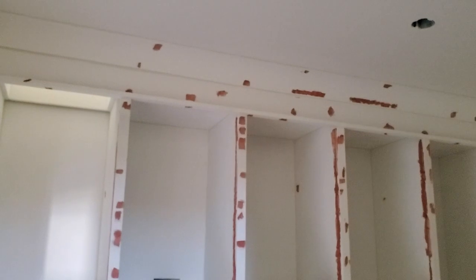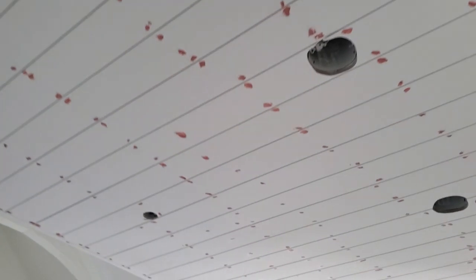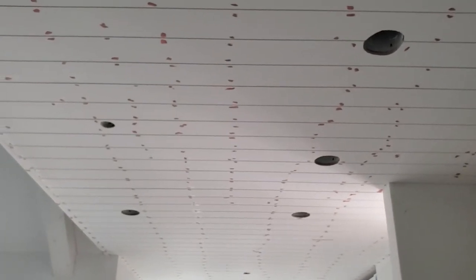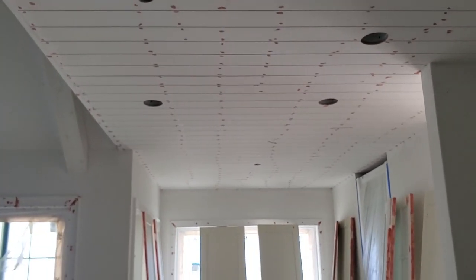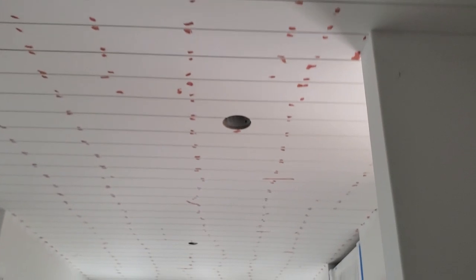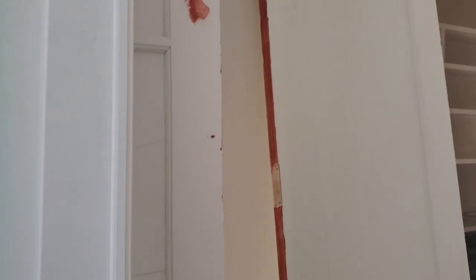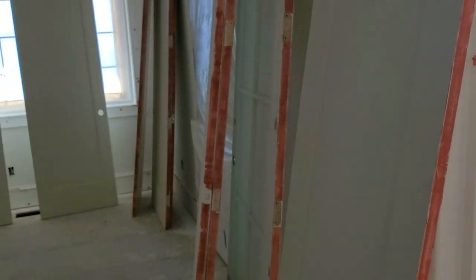Going into some beautiful lockers — those are all closed face. I think we have about 67 cabinet doors here left for us. And here's the famous tongue and groove ceiling. This is going to be really pretty. Our carpenter Alex of Custom Carpentry did this one — nice job. Pretty linear nail pattern, so it makes it a little easier for us to follow. You can see there's going to be a lot of latex. This is a pre-primed MDF eight-foot door, but we still have to address the edges. Everybody's so busy right now those edges will stand out, so we go ahead and Bondo all of our edges.